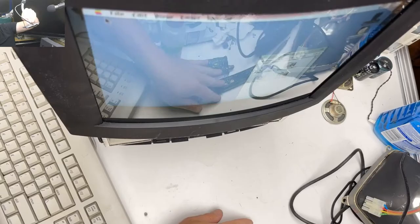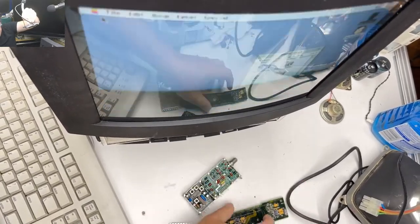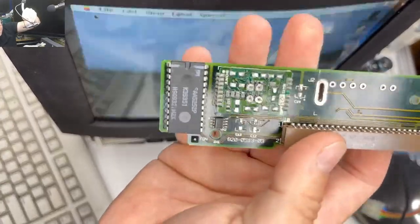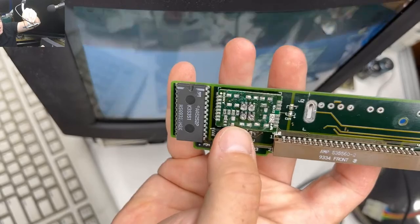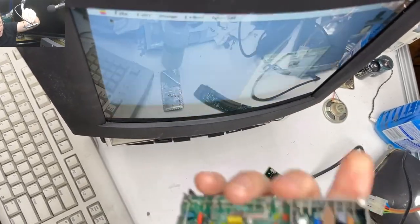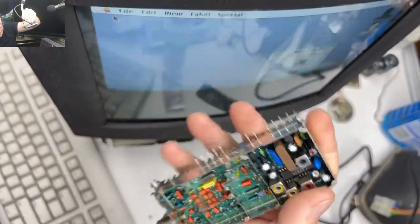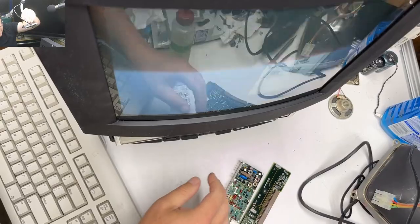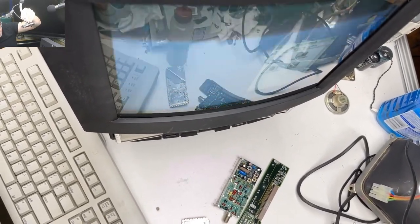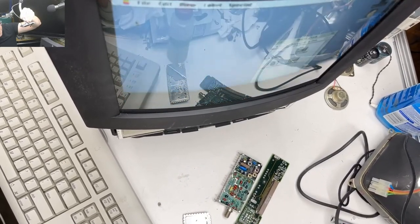Okay, so actually, I forgot. We can't check the TV. Because, one, this little part of the TV board has so many caps that leak, I had to take that apart. And then there are more caps inside the tuner. You can see them in there. So I'm going to replace all those before I put this back together. Yeah, sorry about the flashy. But it worked! How freaking cool is this?